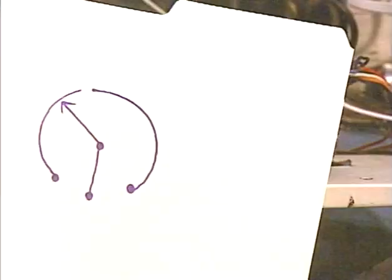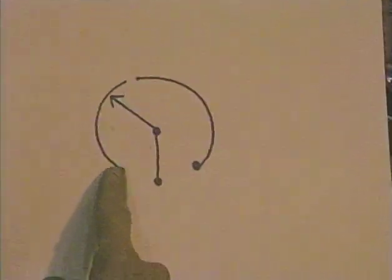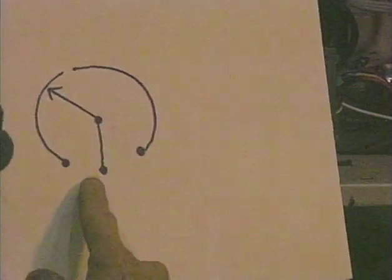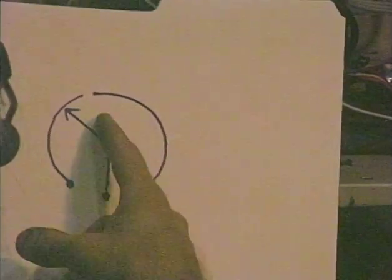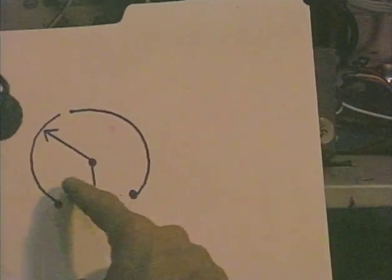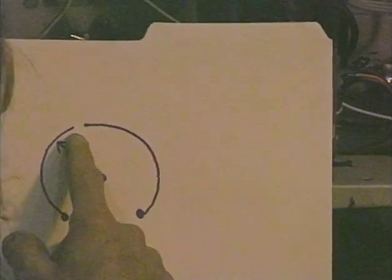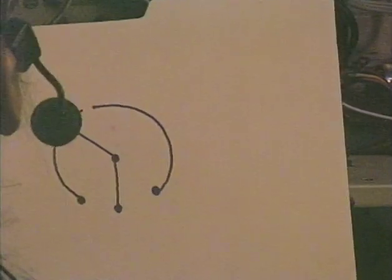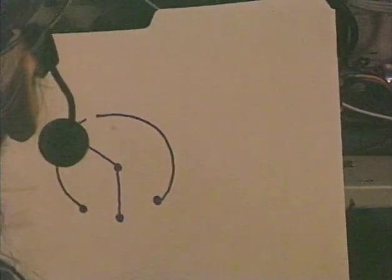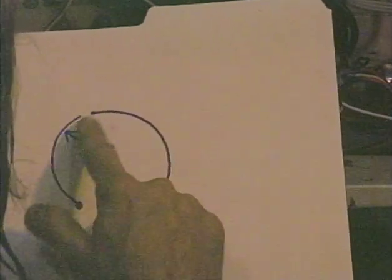I've prepared a little rudimentary drawing here. Your fader control — all the way counterclockwise goes to the left speaker, all the way clockwise goes to the right speaker. You'll notice that this fader has the same problem as this customer's fader: there's a break in the resistance wire. That means there's a dead spot in the fader, and it's only going to make contact at either extreme — it won't do anything in the middle because that circuit is broken.